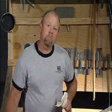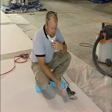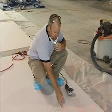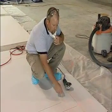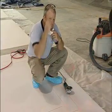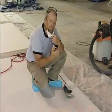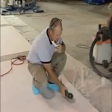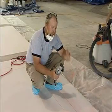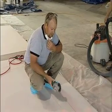Let's show you how these tools can be used. The 4-inch grinder is one of my favorite tools, and here's an example of where it's very useful to terminate the saw cuts where the Sawtech saw didn't get into the corner without an overcut. Remember, safety is not a game. Proper dust mask, safety protection, and in addition to that, we're going to use a shop vac to collect the airborne dust. Remember, if the grinder doesn't have a guard on it, you really need to be careful because this is spinning at a high RPM. But let's show you how a grinder can be used in this application.